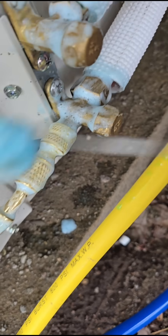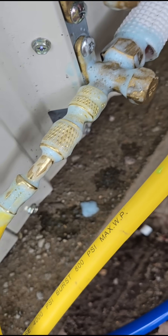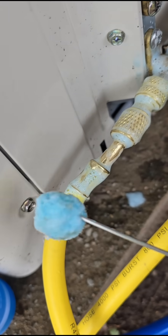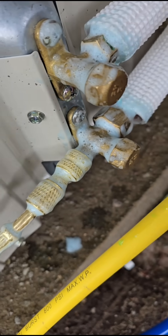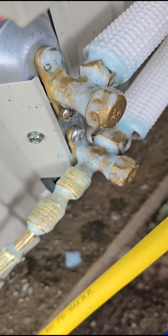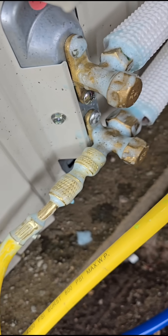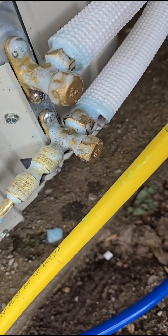You don't keep dipping into more Better Bubble — this is more than you ever need. You just want to cover every seam so that if any gas tries to get out, it'll have to force its way through those bubbles. It's a perfect product and you don't use much. I've seen people go through bottles of this stuff — that's not necessary. If anything was trying to leak out, it would force its way through the bubbles and be instantly noticeable — it looks like a mushroom cloud on an atom bomb, just keeps building as the gas tries to go through the bubbles.